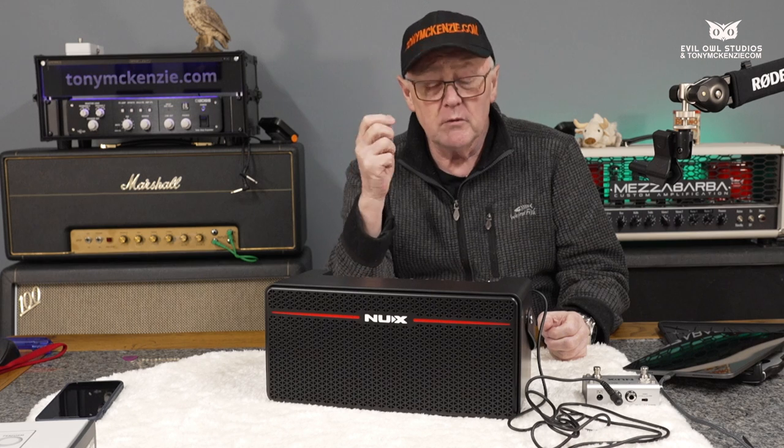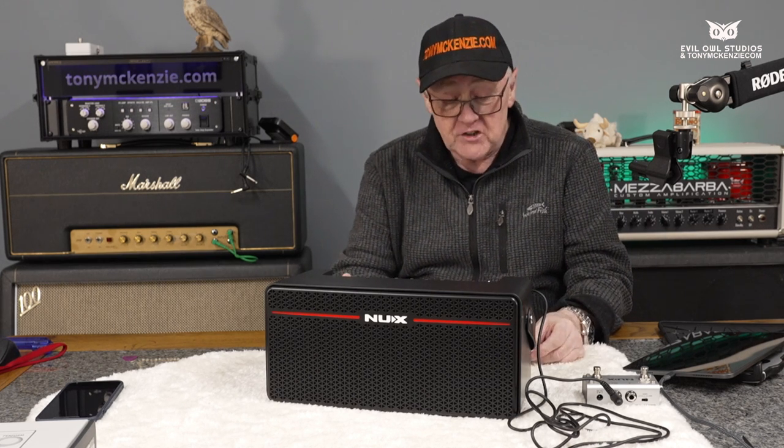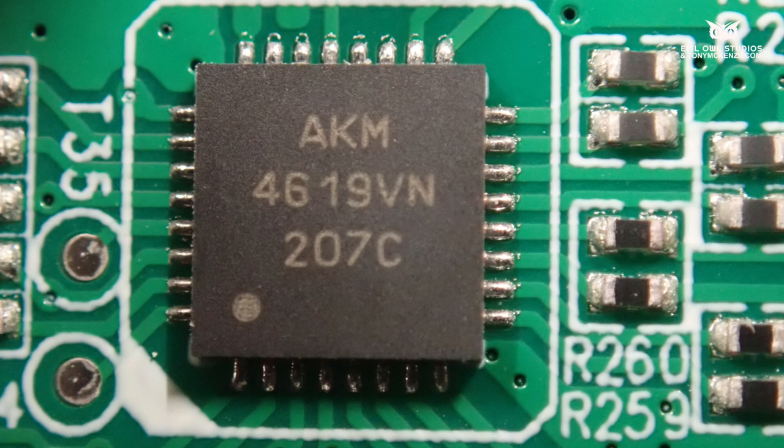Now, once again, a lot of people might want to know about the audio codec, and I think it's important. Anyway, it's an AK4619, a 192 kHz, 4-channel audio codec. As I said, it's a 4-channel, 24-bit ADC, that's A to D converter, which supports an analog gain amplifier. On the output side, the AK4619's 4-channel, 32-bit D to A converter supports single-ended analog output. Pairing this AK4619 with one of many other multi-core DSPs enables processing on both audio and voice as required for modern car audio systems, believe it or not. Can be used in lots of different things, including this Mighty Space amp. Quite an interesting little device, really.